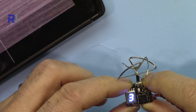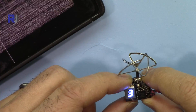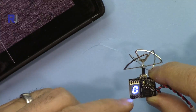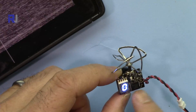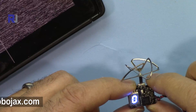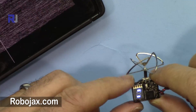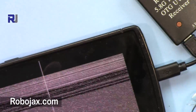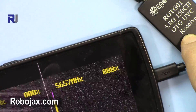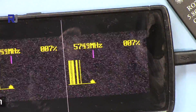Now I'm in group A, channel 3. To turn the transmitter off, hold the button for more than 5 seconds — it will blink and move to the next mode. Pressing it again when '0' is shown means no power output, so it's on but no video is being transmitted. To turn it back on, hold for more than 5 seconds again, then press once more. You can then search for the channel by holding the button.